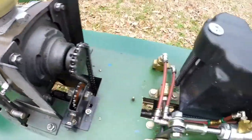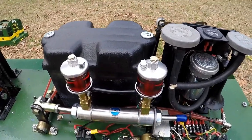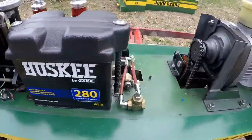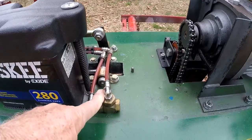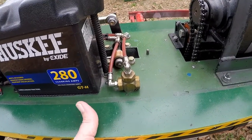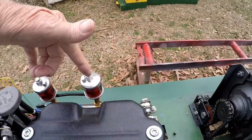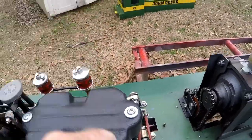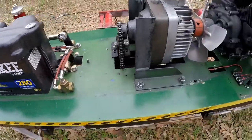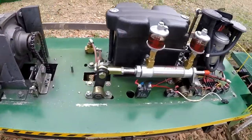This allows the transmission input to be changed from forward to reverse to standing still. The cylinder either has pressure or return depending on how you're moving your stick. The isolation valve allows you to open or close — there's a little knob underneath — which relieves the pressure on the cylinder and allows the fluid to bypass back and forth. When operating the engines together, you have to have this closed.